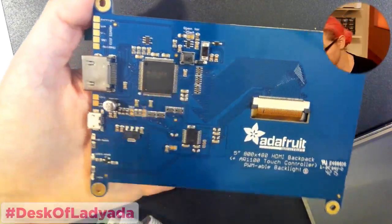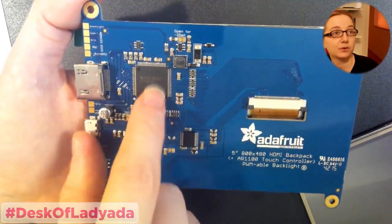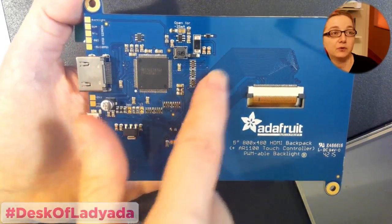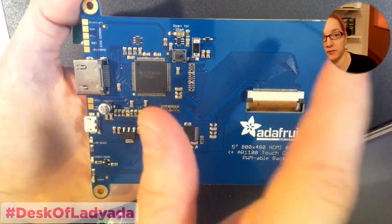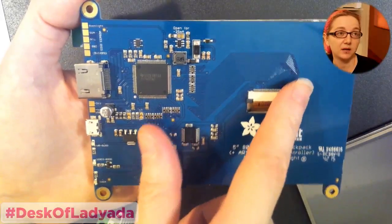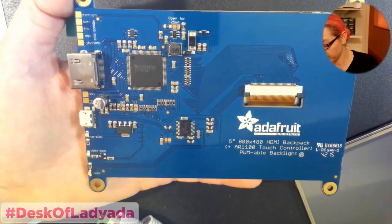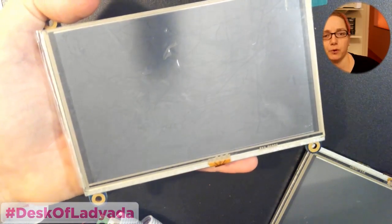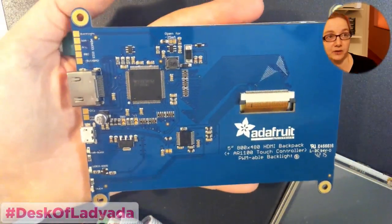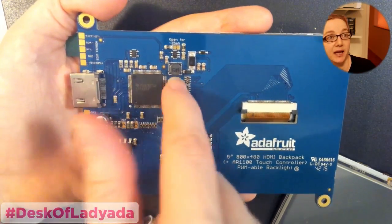What's really nice is that there's this chip from TI, the TFP401A. It's kind of big, but what's really cool is that you have HDMI coming in, and it will give you TTL RGB out. So this is 8 pins of red, 8 pins of green, 8 pins of blue, V-Sync, H-Sync, data enable, and pixel clock. So it's literally just like every time there's a pixel to be drawn, it toggles the data out and toggles the pixel. These TTL RGB displays are very common, and tend to go up to like 1,024 by 800 pixels or so. They're good for smaller screens. Basically, you just give it HDMI input, and it gives you that TTL output.